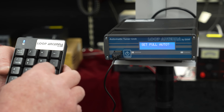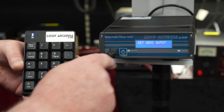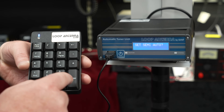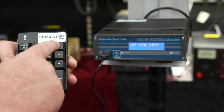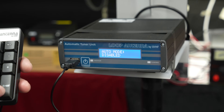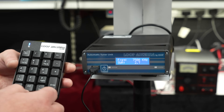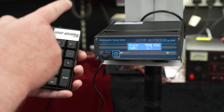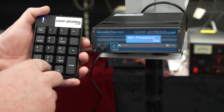You can set it for Full Auto — that's when you need the RS232 port — and you also choose the type of radio. I'm using the plus and minus to go through it. You can set Semi-Auto. I'm going to set it at Semi-Auto in this situation. It says 'Auto Mode Disabled' — that's fine, it's saved. Now it should be ready to go.